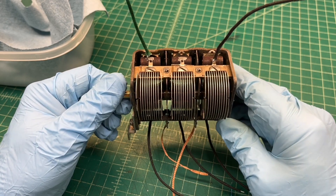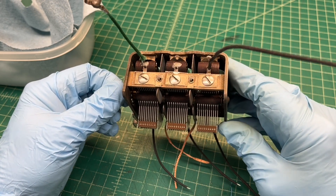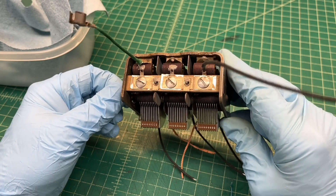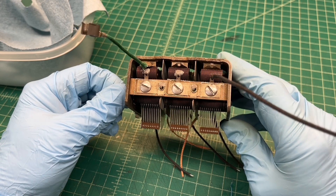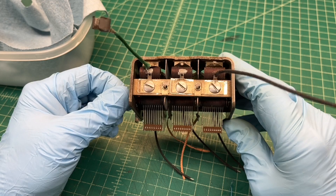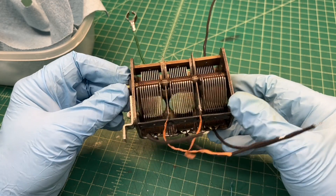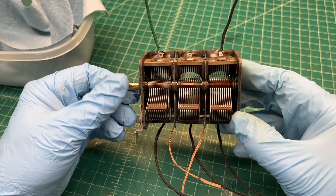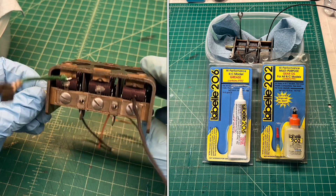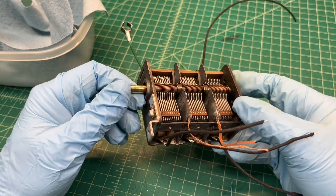As you just saw, about 10 to 12 four-minute cycles through the ultrasonic cleaner with a little citric acid and some dishwashing detergent. You may be able to catch this — see a little bit of glare — new mica for the trimmer caps there on top of the condenser, new lead dress ready to go, got everything oiled and lubricated with some grease.